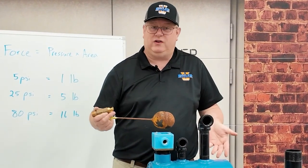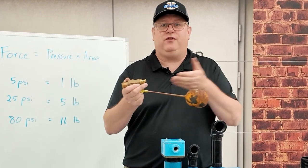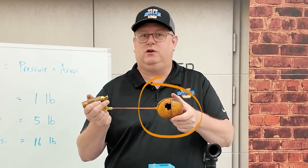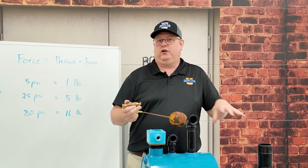The first issue: if your tank's overfilling, you may have to remove and inspect that float valve. It could have garbage in it, or like our model here, could have rusted through and have a hole in it. Obviously it's not going to float like that, so you're going to overfill.